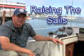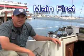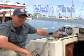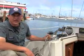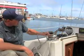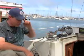Pegasus is a sloop-rigged boat with a roller-furling jib. The best bet is raising the mainsail first. The main halyard is on the port side. All lines are led to the cockpit. Pull the sail up by hand after you get it ninety to ninety-five percent of the way up, then take your wraps to fill the winch.